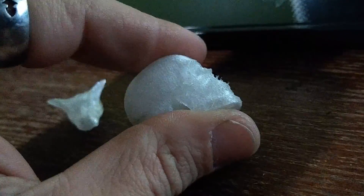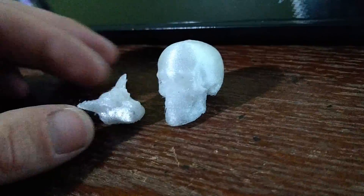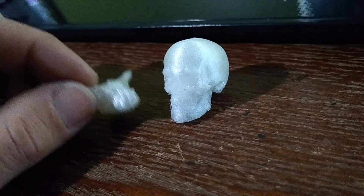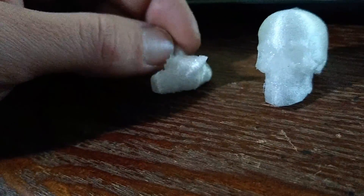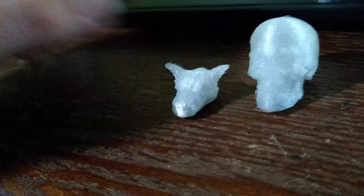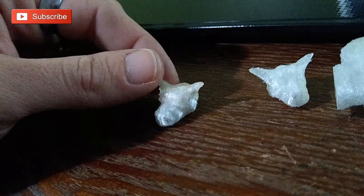You can see it's pretty squishy at 20% infill, but the walls are still pretty solid, so I guess I could have gone a little thinner on the walls as well. We're doing one of these in white right now. I'll have a review video for Polymaker's Polyflex coming up, but this is just a little preview of how well the direct drive can do. We had talked about in the comments about some jamming.